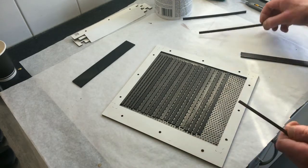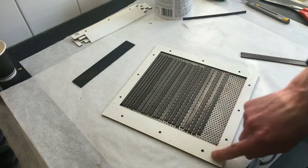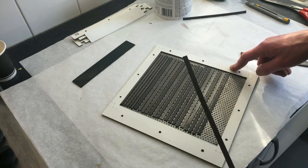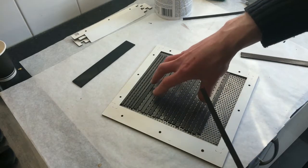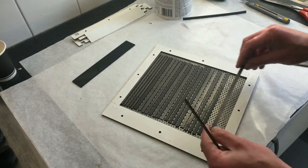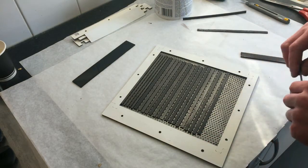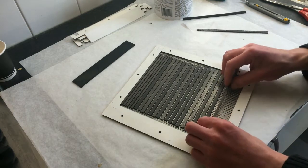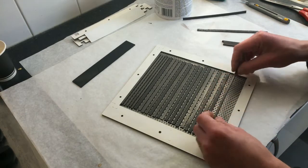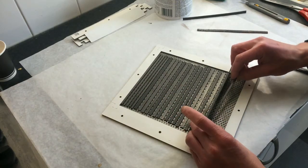I'm going to drop out two of these big ones. I can fit one more but then the wire would not return to this side — it would end here, which is not useful. So I'm gonna lose two of these, which is a total of two windings. The mid-range bass part was about six-point-something ohms, so losing this will make it a little lower in resistance, but that's okay — lower resistance means more power. Now we just have to find the right one to start the tweeter part.